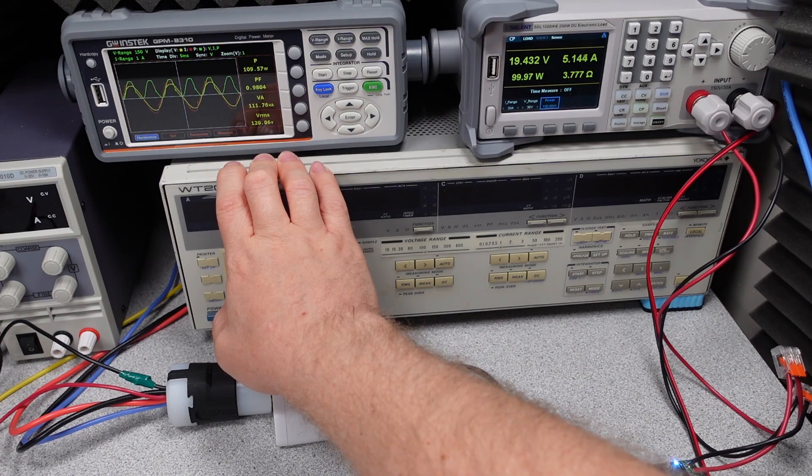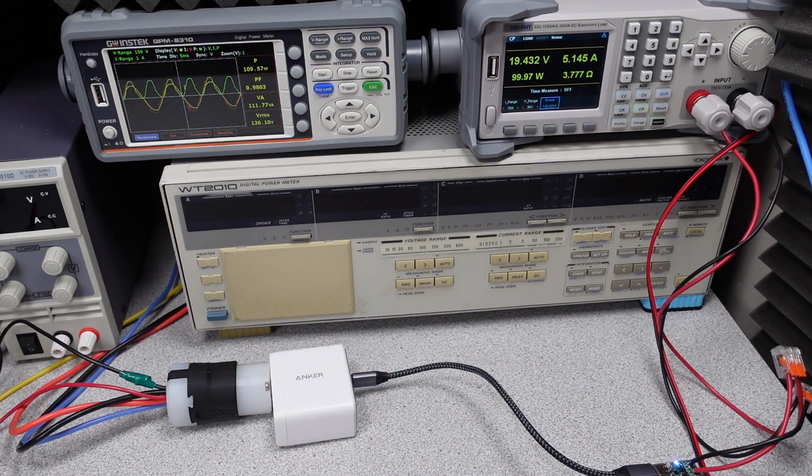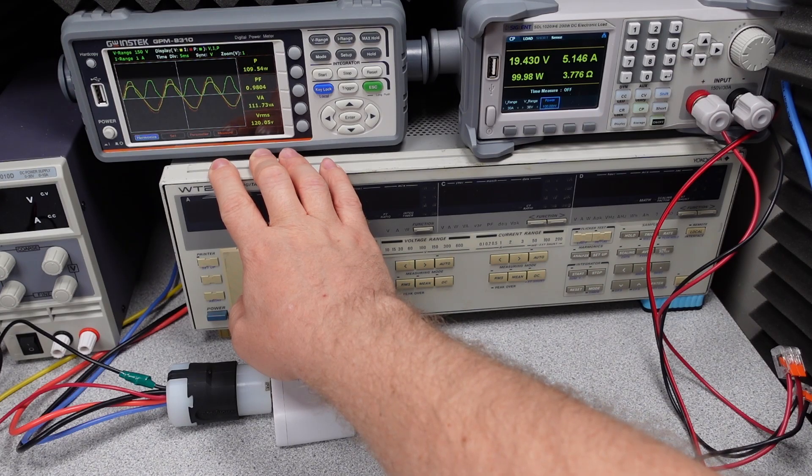Once this device is taken up to its 100 watt output, we can see the power factor correction is in place and the power quality numbers improve quite a lot. When we look at the graph of the power, voltage, and current, we can see all sine waves and all the waves are in phase — on top of each other — which is the best case scenario for AC power. We do still see the random short fast spikes happening though.